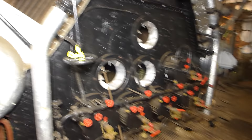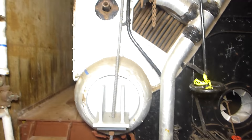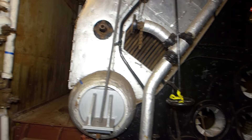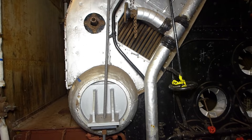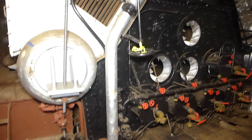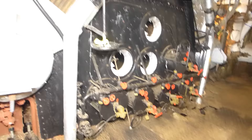There are water drums located on each side. Right now, we can't see into the water drums because they've got brackets and rods attached to them that extend up through into the drying room. They're using these to support some of the weight of the boilers off the frame of the ship. This not only takes weight off a part of the frame that they're a little concerned about, but by leaving some of the weight on it, that actually helps support or brace the frame when the ship is towed. Now let's take a look into the firebox.